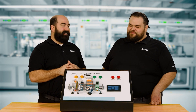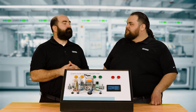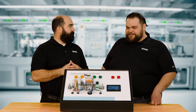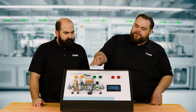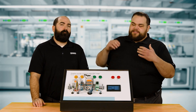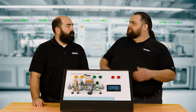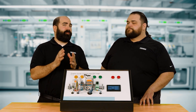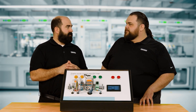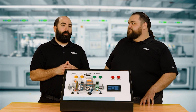The PLC Logic module is designed to be a smart relay that's smarter than all the rest of the smart relays on the market. Instead of having a smart relay with a row of relays underneath for interposing relay duties, we can take that whole extra wiring step out and put the brains directly on the interposing relay. It's a simple level of control on top of your bank of relays, taking that control from a centralized controller and putting it local to the bank of relays.